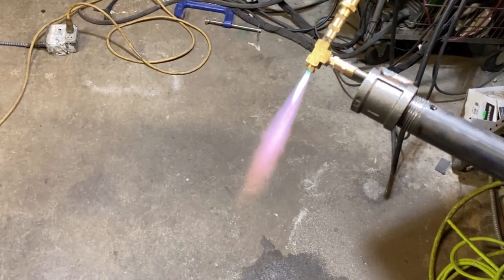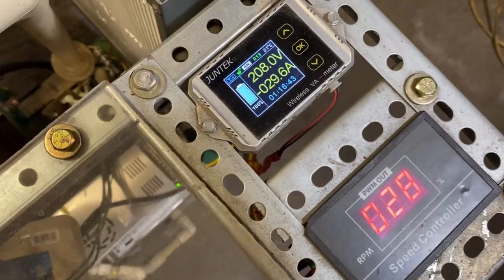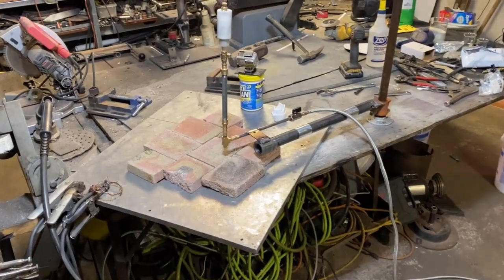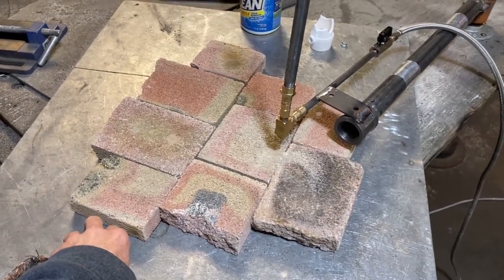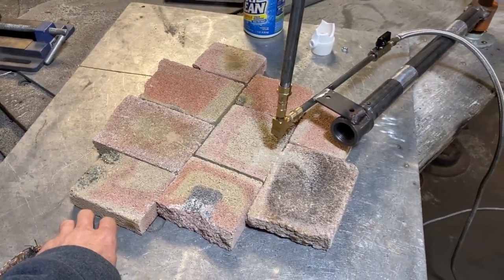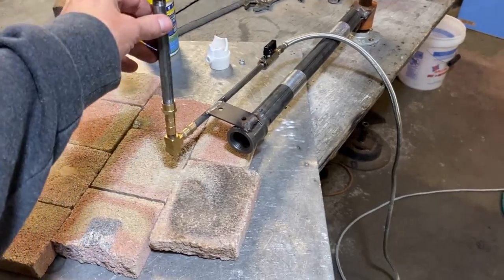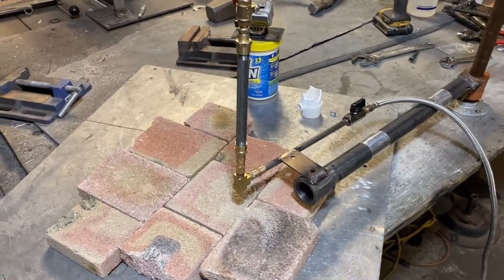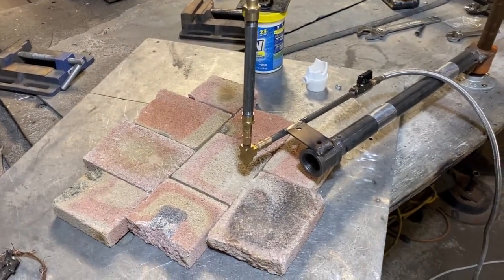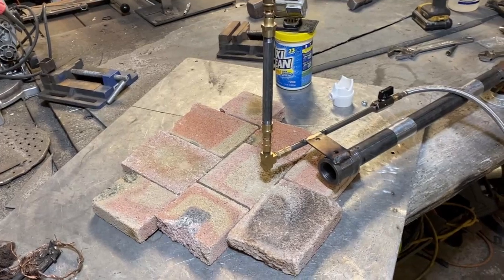That's 30 amps. I'm gonna give this another try today with this massive oxy-hydrogen torch. We're gonna be using gas modification with propane, and this is another attempt at additive manufacturing to make some high-temp crucibles. I'm just using these tests to feel out the design of an actual unit. So far I've learned that the heat flying off of this process is going to require a water-cooled unit - there's no way we're getting away without that. I'm gonna be detonating gas inside this tube before long; this process is gonna get screaming hot.